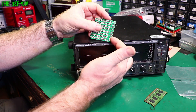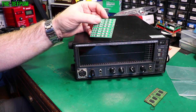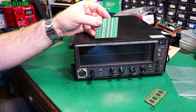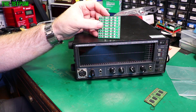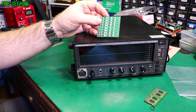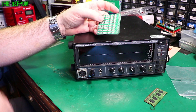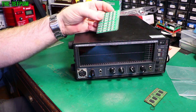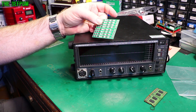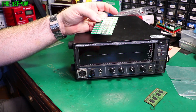What I found was it charged up, said no current going because it's charged, but then turned off within like two minutes - which means it's not charged. That's when I discovered my lithium cells had gone out of whack. I actually opened this up and manually charged the weak cell to bring it back up to roughly the same as the others. It's basically balanced now, but that will go out again because that one cell's a bit weaker than the rest. So what I'll do is tack this balancing board across the cells and that will automatically balance them during charging. Let me know in the comments if you think I should do a video on adding one of these boards to a lithium pack.